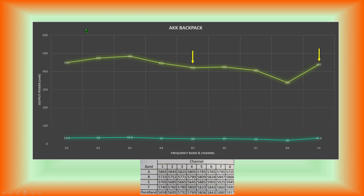This is the overall summary for the output power levels of the AKK Backpack VTX at the 25 milliwatts setting and at the 200 milliwatts setting. At the 25 milliwatts setting, the AKK Backpack is averaging 29.8 milliwatts. At the 200 milliwatts setting, it is averaging right at 400 milliwatts — and that is not an error; others have measured this as well. Channel R5 at 5806 MHz and F4 at 5800 MHz are close together in frequency, so I would expect similar output power levels, and in fact they are: at 200 milliwatts setting they differ by only 14 milliwatts, and at 25 milliwatts setting by only about three and a half milliwatts.